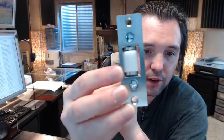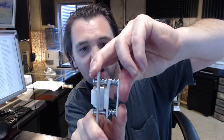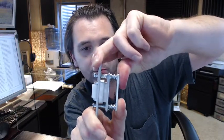There's complete adjustability on these two springs by the settings on the screws here, in terms of how far out that roller is going to project. Obviously those screws aren't going to project because they would be tightened down. I'm just emulating getting the roller stuck out, and that's going to tell you how much friction you've got. I have had people in the past complain that these are loud, and you do hear them snap open and closed. That is true, and that's just a fundamental of what you're dealing with. So understand that these will give off a small amount of noise. Well, in over 20 years, I've only heard that complaint twice, and I was very suspect of the origination point of those complaints myself.